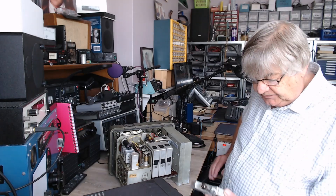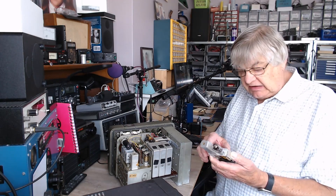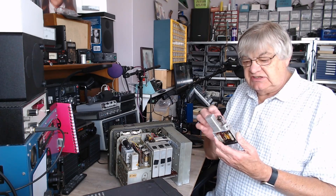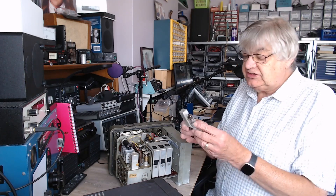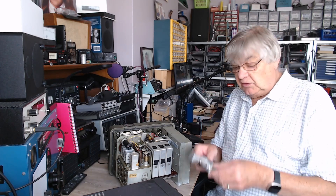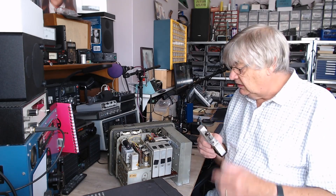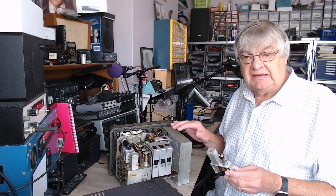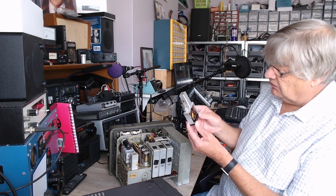As there is noise on FM and it's working on FM, but not AM, I am assuming — deducing, there's a word — that it is the AM detector which is this. The disappointing thing is the valves. It's a lovely receiver, well-built, 1951 I believe, but the disappointing thing is these valves — DAF 91. They are the 1.4-volt heater valves used in little suitcase radios.